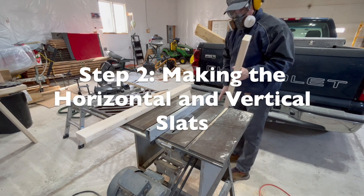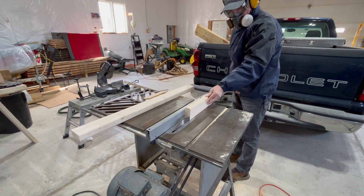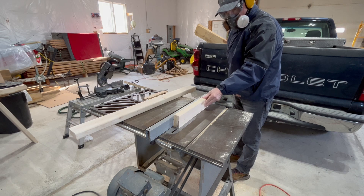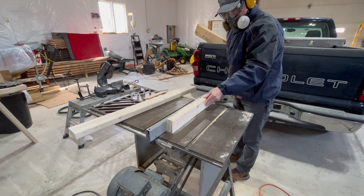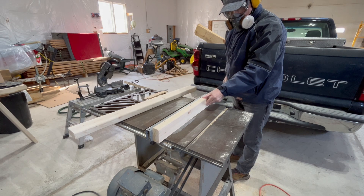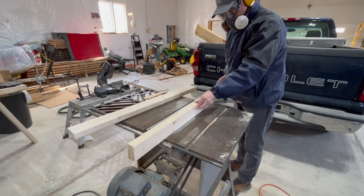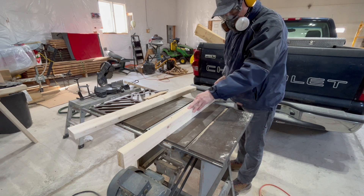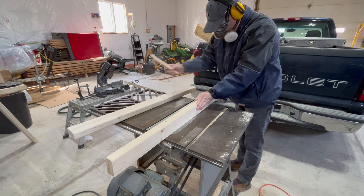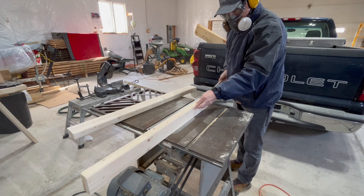A good air filter is not going to stop all this fine dust. I still need to improve my sawdust collection system, and that will address the sawdust that falls beneath the saw and to a certain extent address the fine dust. But the air filter is to address the dust and the particles that get into the atmosphere of my shop and hang around. The air filter will literally, within a matter of 10 minutes, recycle the air and clean it so I can walk around in there without having to wear my respirator.